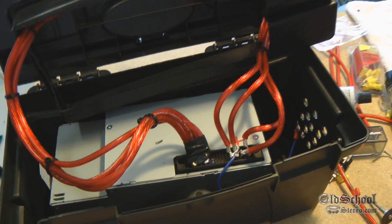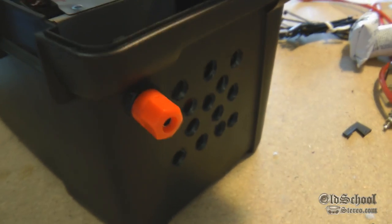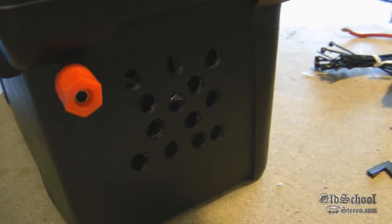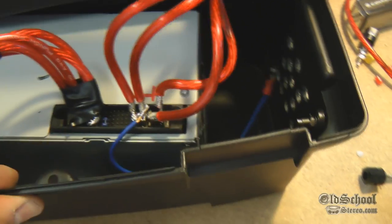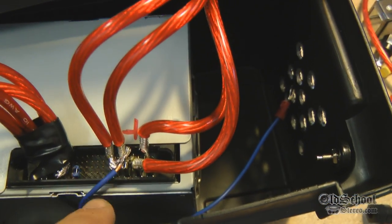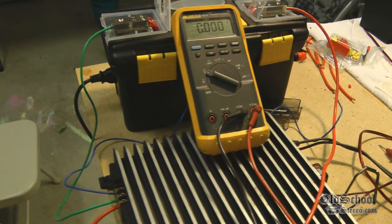I got a little carried away and went ahead and did a few other steps. I soldered on the negative side, put some tie wraps to make it look nice, and made a hole in the side for the remote — that way you don't have to run it off the same wire that comes out of the top. I also drilled some ventilation holes for the fan on the power supply. Now I just have to find a way to attach the power supply to the box — probably some kind of epoxy. I also soldered an extra wire on the positive side which is going to give us the 12-volt turn-on for the amplifier — we're almost done.